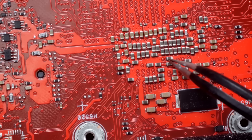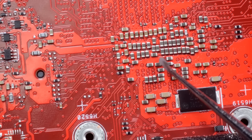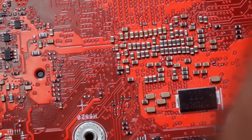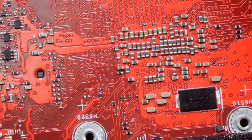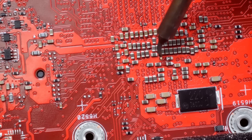I'm going to get a soldering iron and see if we can just re-solder this capacitor. I'm going to come in with just a little bit of flux — that's going to help the solder flow. I've got our fume extractor turned on and the iron is nice and warm. Let's see if this thing will solder. If that pad is torn, there's a good chance this isn't going to solder down correctly.